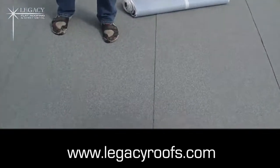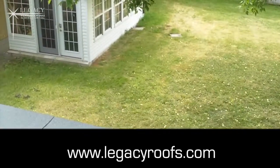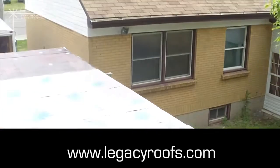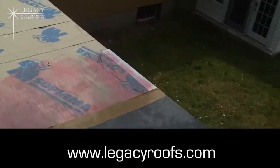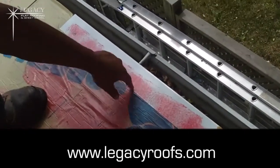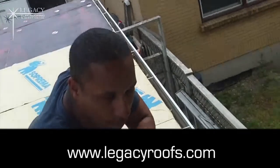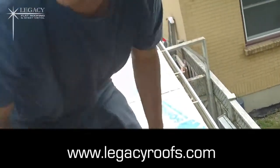Okay, so we're a little over halfway point. We have the base sheet in. We primed it. We put some cap sheet in. We've put some drip metal flashing along the edges to give the nice clean look. So you can see the base sheet, and you can also see the detail we went with. We went with a base sheet, drip metal flashing, and then a cap sheet. If you're looking down from the bottom, you get a really nice clean look. Like I said, remember when we cut the old roof off? Just looks nice. So that's where we are with the flat roof.